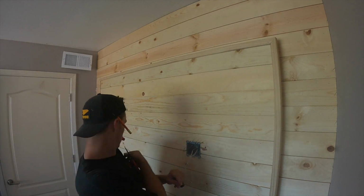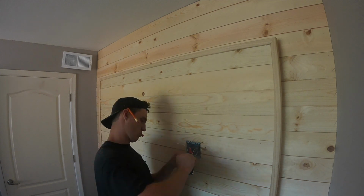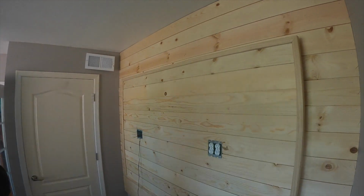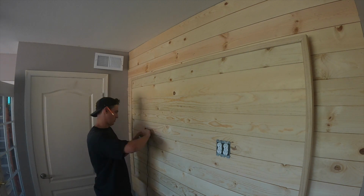So I got a couple receptacles on the right here, you know, Xbox, DVR, DVD player, cassette, whatever you plug in on this TV wall. Probably a TV plug in there. But on the left here, as you can see, I have a receptacle. I'll put it upside down to indicate that it's like a switch controlling it.